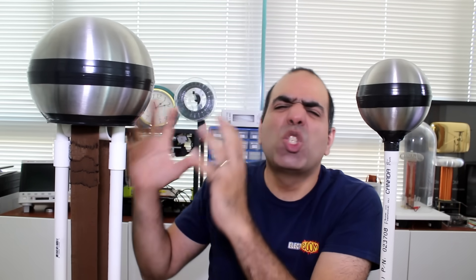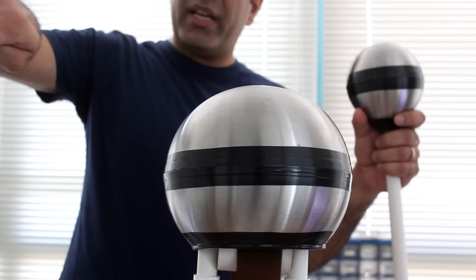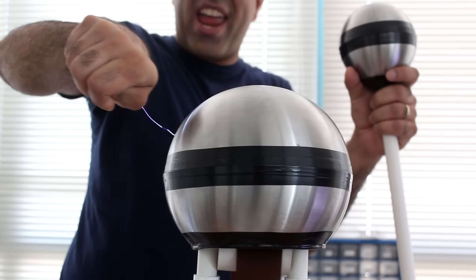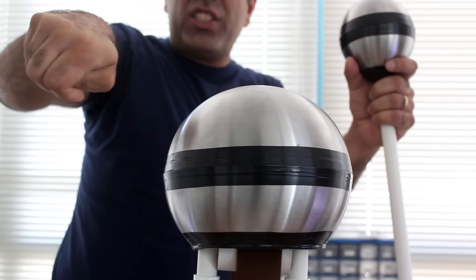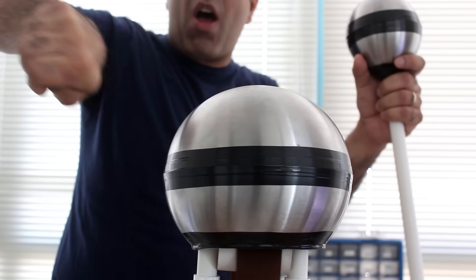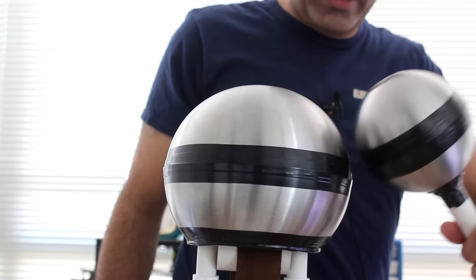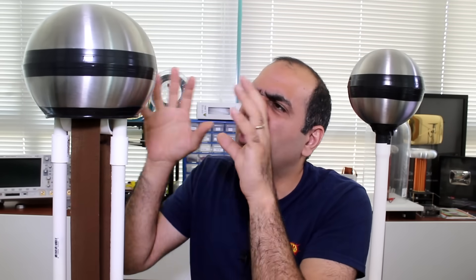Basically this machine creates super high DC voltages that are stored in its capacitance, which is between its top dome and the earth or surrounding conductors — or this ground ball, for example. I'm holding the ground ball in one hand, and from the size of the arcs jumping out over four inches away, I can say that the voltage of the dome can be over two hundred thousand volts. It's a capacitor and can hold charge for a while. If the tower were taller and further from any conductor and in vacuum, the voltage would rise much higher. But with the belt constantly putting charge into the dome, you would expect the voltage to keep climbing — but that's not true.